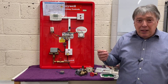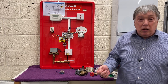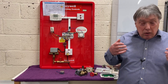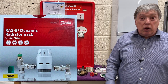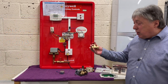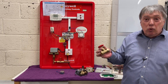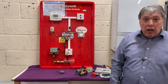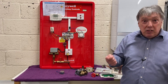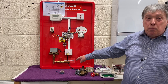A radiator in the bathroom or the hall is not an automatic bypass — it's not a bypass at all. It's just a radiator that's on full, nonstop, with no control. British Standards require that every radiator has a TRV, and make it smart. The Danfoss balancing TRV on the return is brilliant — that's what we should be doing. Don't stick a gate valve in and turn it. They also put these on a cylinder to restrict flow, which means the heating cools down and your gas or oil bill goes up. We want recovery to be as fast and efficient as possible. Automatic bypass on every system, please.